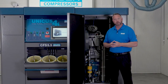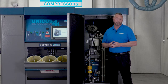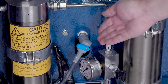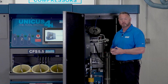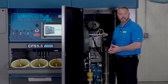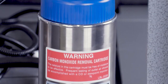The compressor block is built for continuous duty 24 hours a day, 7 days a week, and doesn't require a cool down period compared to a cast iron block. The compressor comes standard with a high pressure sensor, low oil sensor, and automatic condensate float switch. All of these are preset by factory personnel so they shut the unit down before any harm can come to the system. The purification system built by Bauer Compressors can produce an air capacity from 67,000 to 150,000 cubic feet and comes standard with the patented Bauer Securus moisture monitoring system. The Securus provides a warning to the operator when the purification cartridge is about to expire.